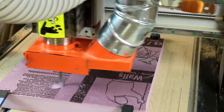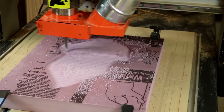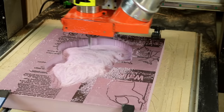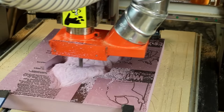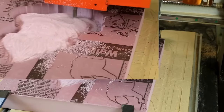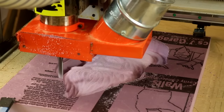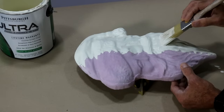That's a piece of standard pink building foam right off the shelf at a home center. Because it's two inches thick, this provides a great way to test your cuts in a relatively inexpensive material before you throw a really expensive slab of wood onto your CNC. Or you can use it for what I'm doing here and create 3D artwork. The roughing-out portion of the cutting is being done with a half-inch end mill — that'll get most of the waste removed. The detail work is being done with a half-inch round-nose bit, which works here because the artwork is pretty good size. If you're working on a smaller piece and need all your details, you'd probably have to go to a smaller diameter cutter. The final outside shape is being cut with a half-inch end mill — same bit we did the roughing pass with. Again, I'll leave tabs behind to bridge the work piece to the frame. A little bit of latex paint and we're good to go.